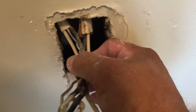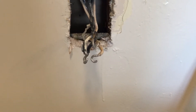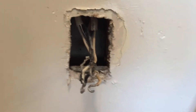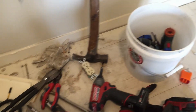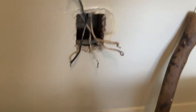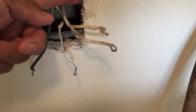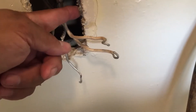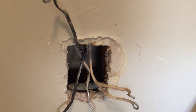I have a few box options. There's a plastic one with a plate that slides into drywall — I don't like that one because it might break later, even though you put a screw through the box. Then there's one with a metal plate, which is very interesting. And there's the original style junction box where you turn a screw and a hook goes up and stays behind the drywall — one on top, one on bottom. This is the heavier-duty version with a metal plate; you can actually adjust it with a screw in the back, which is nice.